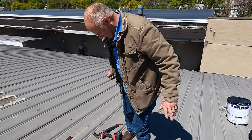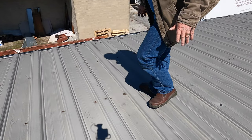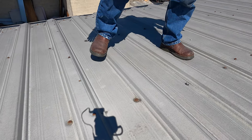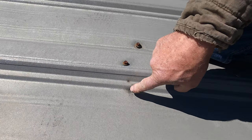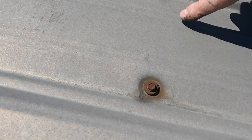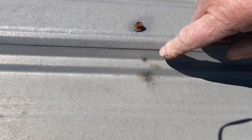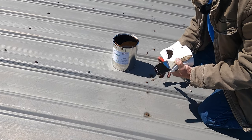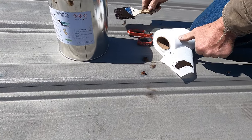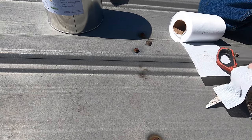Let me show you some more areas where it can leak. There's rust right there at this edge. You've got to look for little holes like this. They happen because there's a slight bend on this roof on this edge here — a slight bend — and it's causing this. This is how you fix it, very easy, simple. But if you don't see it, you cannot fix it. There are holes there.